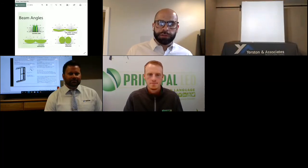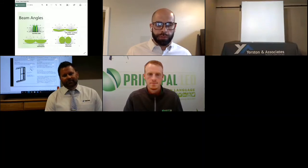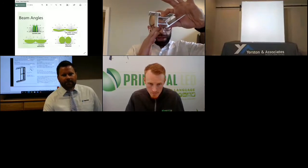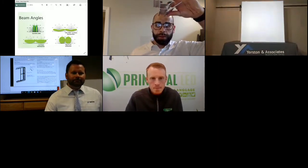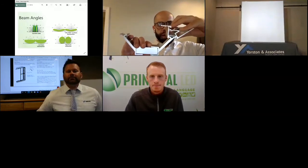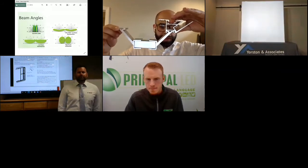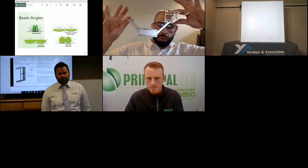But if you're retroing something in the field or even building something new and want to eliminate frame braces, we have the retro frame brace, and I brought an illustration. So here's our 2107. Typically what happens is we have that frame brace that kicks back like this, and then it goes down to the complete bottom of the cabinet, right? So with the new retro frame brace, it actually goes to the backside, to the other face, and that counter pressure from the other retainer compresses and it supports that retainer system.